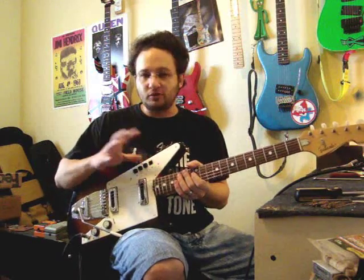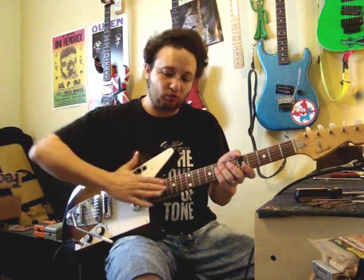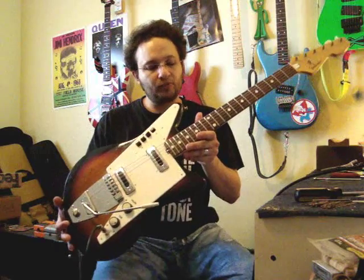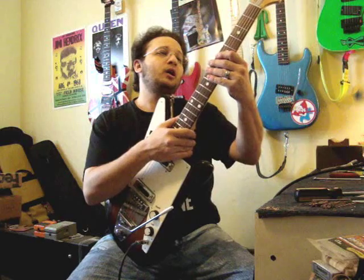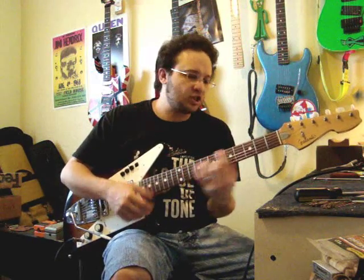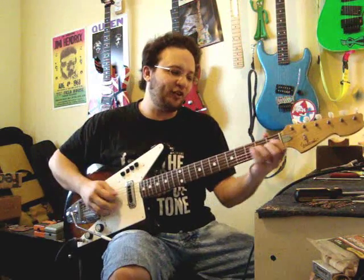Well, actually it was a mixed joy, because the fingerboard had some waves to it, especially towards the end. It had a lot of rise over here. So it took a lot of planing to get this neck straight, and I thinned out the fingerboard a bit up here, but there was no choice. The end result ended up being a guitar that has such a smooth action to it, such a smooth playability. This is just a really, really fun guitar.